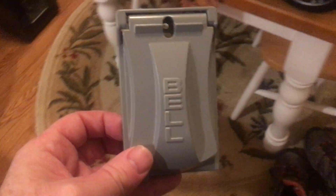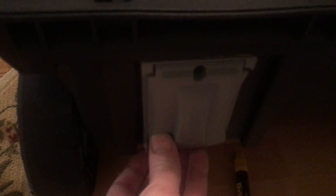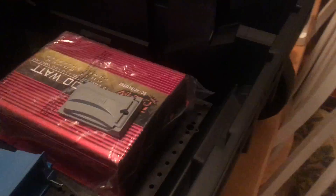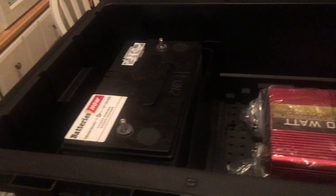I got this nice bell piece. The 110 outlet on the side will come out of the inverter through that and it'll be right here on the side. For the 12-volt stuff, I'm gonna mount it right here on the front. I'm gonna have a little board with a battery voltmeter to tell me what the voltage is, 12-volt, and then two USB plugs. I could also mount the plug where I'll be plugging the solar panel into this, and it'll go through to the battery leads.